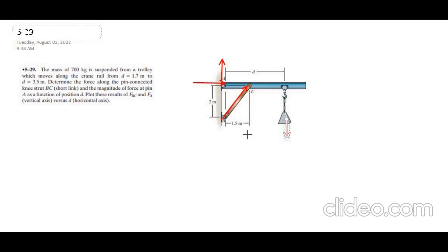Now we have to resolve this inclined support reaction from link BC into its components. It has one horizontal component and one vertical component. Let's label them: the vertical reaction at A is A_Y, the horizontal is A_X. For the BC force, the vertical component is F_BC_Y and the horizontal component is F_BC_X.